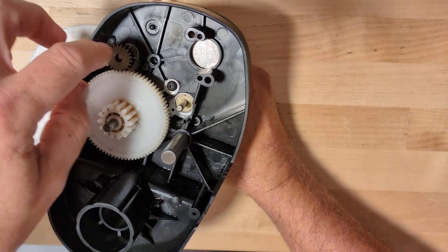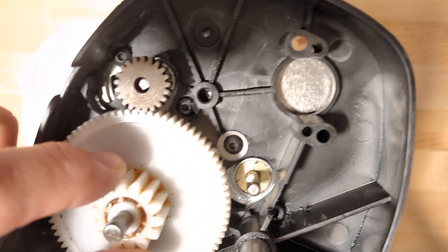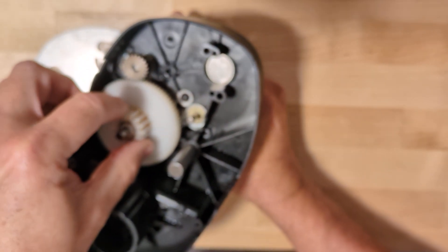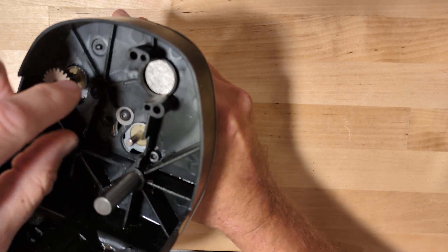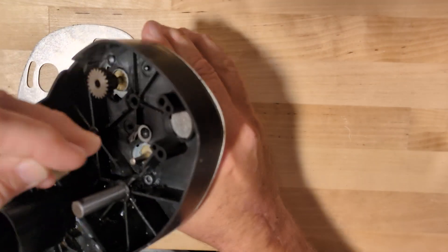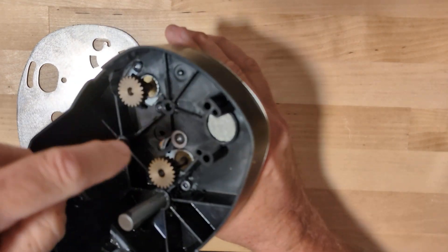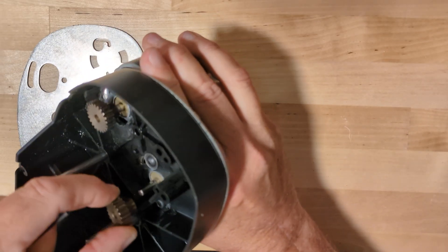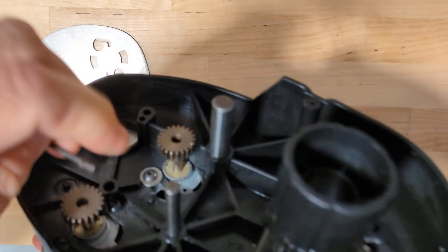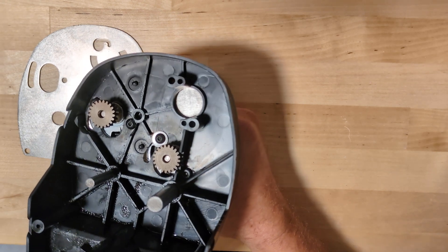When you set them in place, you're going to have to get the gear mesh right. There's a hair of play — your goal is to get a little bit of play in there. The way you do that is bolt the motors in so they're almost snugged down but you can still rock the motor when you turn it. Set the pinion gear in place. You're going to need an Allen key that's got a 90-degree bend to it. You want thread lock on all of these screws. Get lined up with the flat spot, slide it on — we've already got a set screw on there. These are 21-tooth pinion gears.